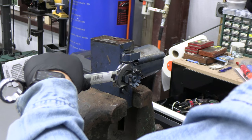Here we go. Okay, we've got to take this final screw out. So I've loosened it up. It's got a long thread on it. And that's got another ball bearing in it also, so there it comes. And then one more important piece down here. Let me tip this up. This needle valve comes out of this hole. That's held in there by that spring.